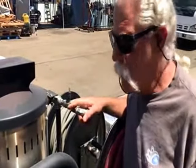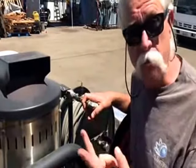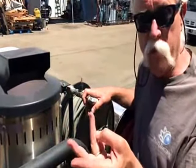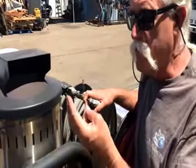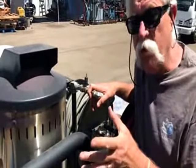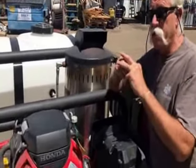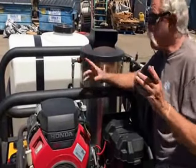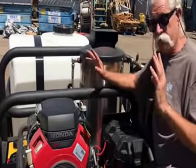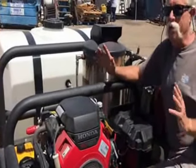And it was a mistake in training. So we're going to bring this guy up to speed on how and when to use a chemical injector. We're going to bypass the unloader back to the holding tank so it's more reliable and easier to troubleshoot. And we can eliminate the thermal relief valve so we're not sucking air into the pump and causing it to go bad prematurely. Any air bubbles or cavitation on a direct drive pump shatters the shafts because it's just metal on metal in there. If you want your machine to have a chance to live a long time, this is not the combination you need. If you're stuck with this combination, do these upgrades — or just call Pressurewasher.net and get it done right the first time.